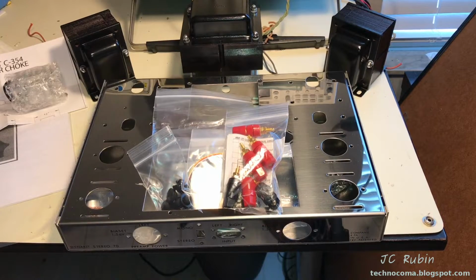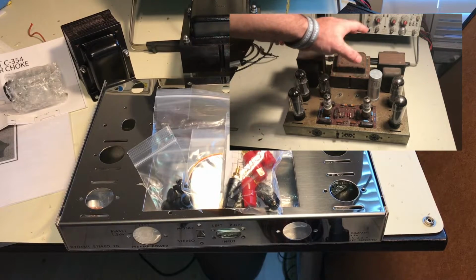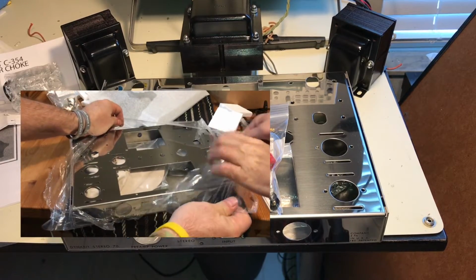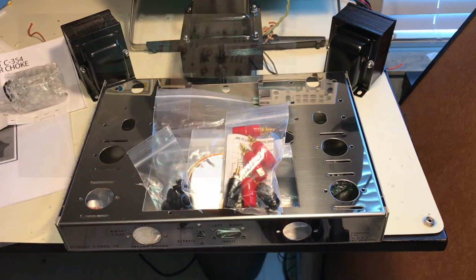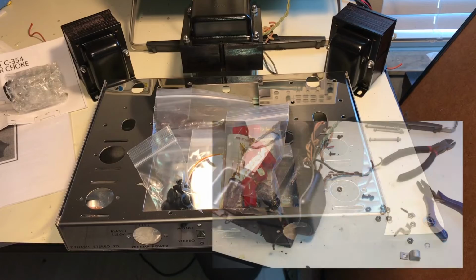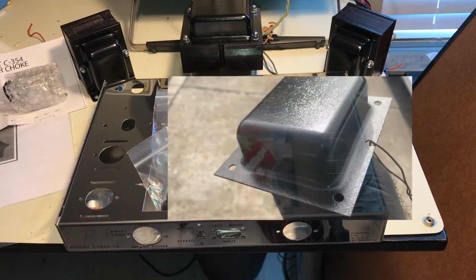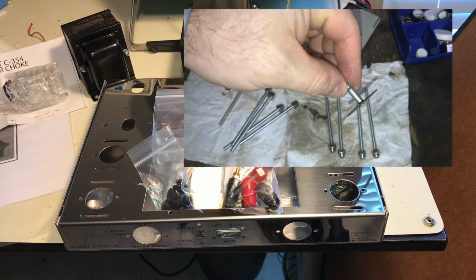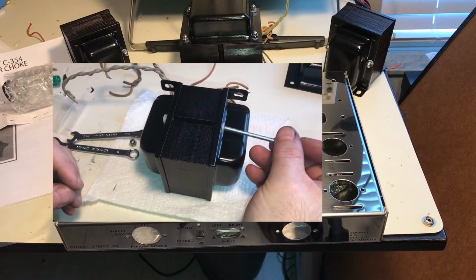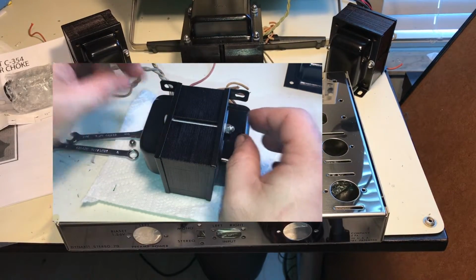In the last episode, we started with an introduction of this amplifier as it was originally restored in the ST70 resurrection video several years ago. We did an unboxing of the parts, and then we started to mark, annotate, and strip down the transformers off of the chassis. These transformers then had their shells removed so they could be taken down to Jason's to be sandblasted and stripped. They were prepped and painted. Custom bolts made out of threaded rod and acorn nuts were fabricated. They were reassembled after the transformers themselves were also painted to improve their appearance. And that's where we left off on the last video.